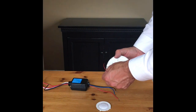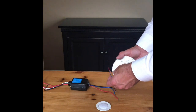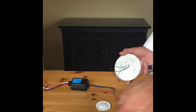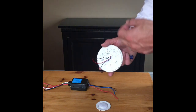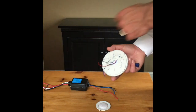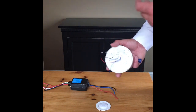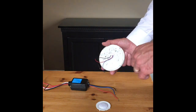Just to cover the wiring again, we see a replication of our red, black, and blue wiring on this sensor as well. Now some motion sensors have quite a few wires — additional wires can be for a few things. They can be a dry contact output to an HVAC system. We see that a lot in schools where they take a dry contact and put it into the air handler in a classroom, so that when the room becomes unoccupied the air handler shuts off. Some can also wire into switches. The key is there's a basic system architecture we're showing you, but they're not always the same.